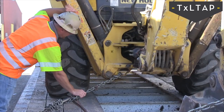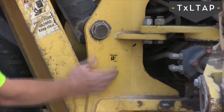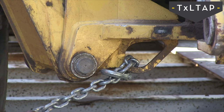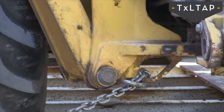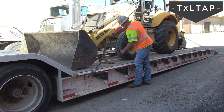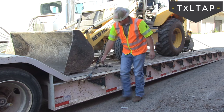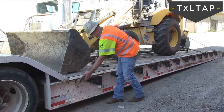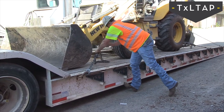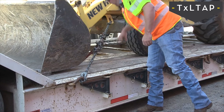If you're not familiar with load and tie-down, there's an emblem on the back of the machine showing you a load and tie-down point — that's what you're going to want to tie down to. Ninety percent of the equipment you'll be working with, county or statewide, is going to be labeled like that. On the front of the machine you'll also have tie-down points. Keep in mind: downward pull on your hooks all the way around, make sure the chain is all the way in the hook, and make sure you've got good secure tie-down points. Tighten it down and take your excess chain and throw it over the chain.